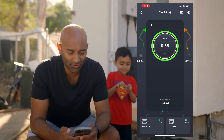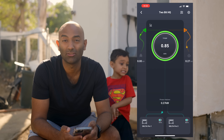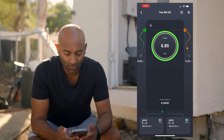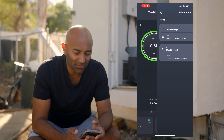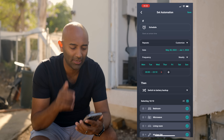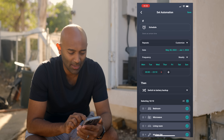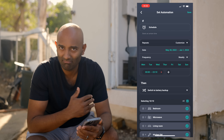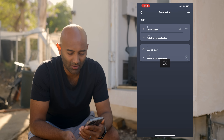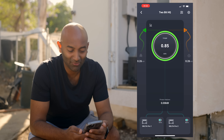The app shows you the grid and the house consumption. Right now we're using about 280 watts, which means the refrigerator is turned on. We're feeding it from one EcoFlow Delta Pro battery. The reason it's feeding the house and not the grid is because of this rule here. So if I were to turn it off — this rule says that between midnight and 11:10 at night, power the house. It was just for testing, but I can turn it off here. I heard a relay just turn off, and now we're pulling from the grid.